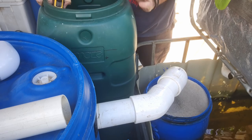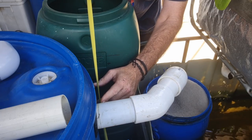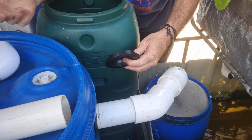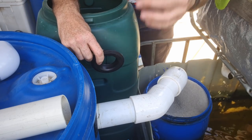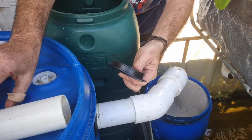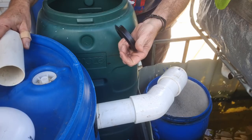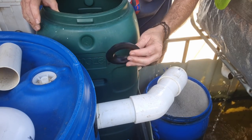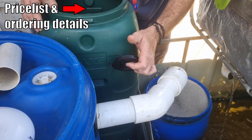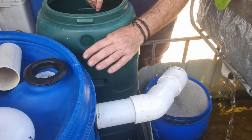I've just turned it around so the outlet will go a little bit further down on this side over here. To work out how high I need to drill, I've basically just used a tape measure on the ground, taken halfway up the height of this pipe, moved it over here and we're all ready to go. I will be using uniseals mainly because they're nice and easy to use and they're cheap. With a bulkhead fitting you need the bulkhead and then the threaded adapters to go either end to make them watertight, whereas with the uniseal I can just pop this in, push the pipe through, push couplings on, make sure they're well sealed and away we go - a lot cheaper, a lot easier to use. Not everyone's a fan of them but I like them - in fact I like them so much I sell them, so you can check out that little link up there if you're in Australia.